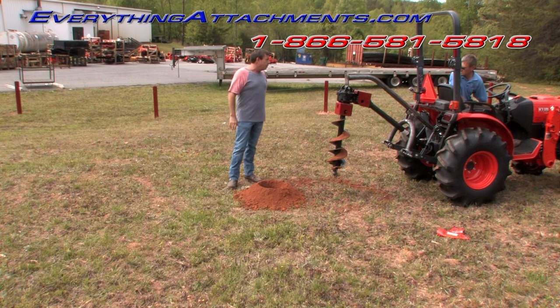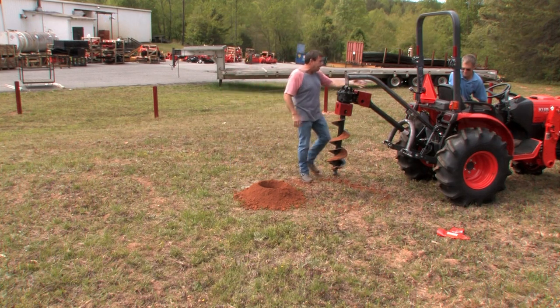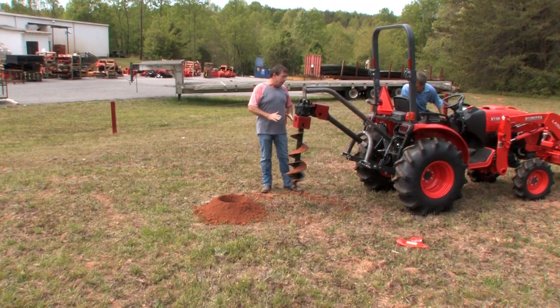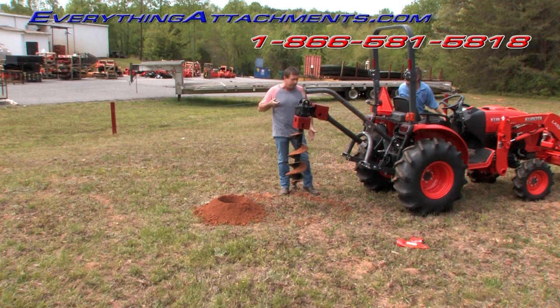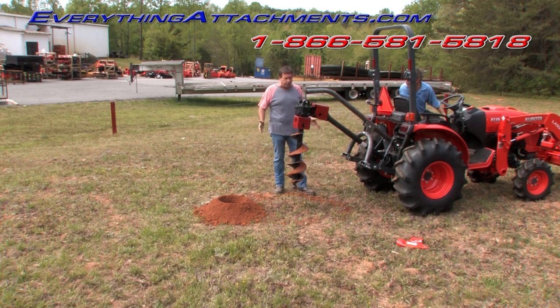I think this is going to work. We'll try it on the BX next to make sure we've got our clearance right. We've redesigned this front piece about three times just to get the top link length to not bind up in the particular way the BX is built. We want to keep this boom as short as we can so you've got good leverage once it goes into the ground to pull it back up, and we want the geometry on the bottom to make it easy for you to hook up.